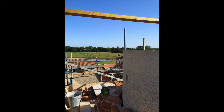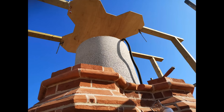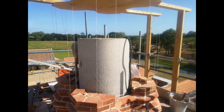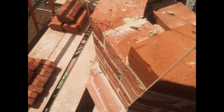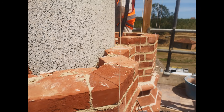Here you can see I pinpoint the laser on the center of each side and then project it up onto the go-posts — I did that on all four corners. From there we could attach the main template, and once this was in place with the first courses of squints, we could attach the lines and just follow them. As long as Harley and I kept gauge and level with each other, all the plumbing up was done on the lines, which really speeds the job up. Every single brick you see there is cut on site, laid ready on the scaffold to those lines.